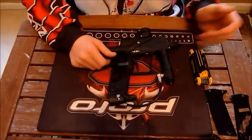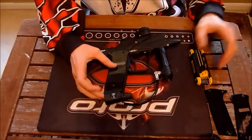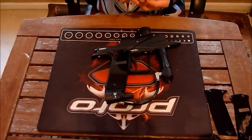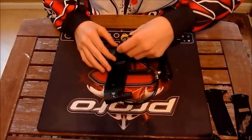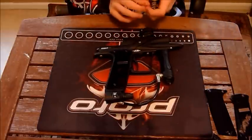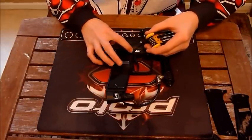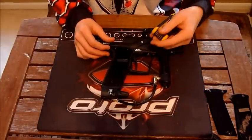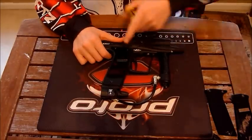They said the grips can change screw positions and that could also cause cracking. So I had it on basically finger tight, then came in with the Allen key again and turned it an eighth of a turn from where it was when it was snug. Any tighter than that and you'll start to see this doming kind of down — that means it's too far in. With the glare of the light you can actually see the grips doming down.